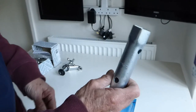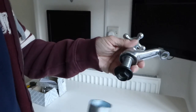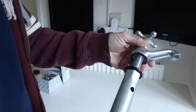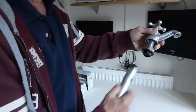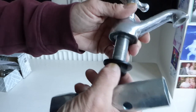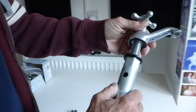Moving on, we have this spanner — I've taken it out of the box now. You don't need to buy an expensive one; these are pretty cheap. This box spanner: why do we need it? Because this is a typical style of basin tap. That end is too big — that end is for a bath tap and will fit a bath tap back nut, but this end will fit the basin or a sink tap. So if you use this type of tap in your sink or bath, you will probably need this to undo it. The basin spanner will undo the pipe nut and probably get that off, but it might not undo this back nut because it tends to round off a plastic nut and slip — especially if it's plastic, and even if it's metal it can be so tight that the basin spanner won't get it. That's when you need to get your box spanner up there and undo it.